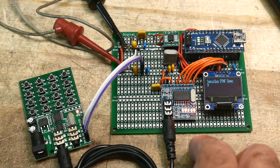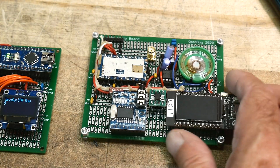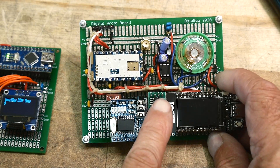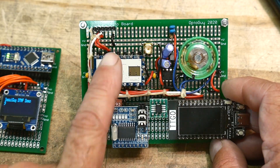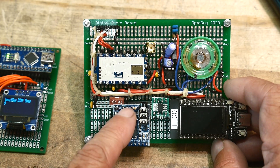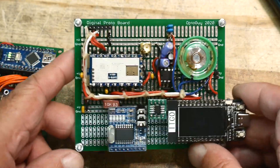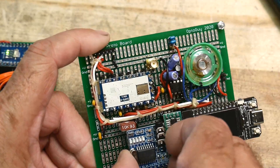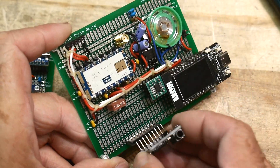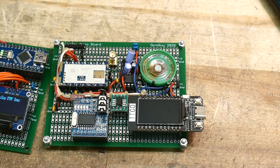My next step is going to involve this board — my radio-on-a-chip controlled by a microcontroller. I'm adding an encoder and decoder to this board, so now it will be able to listen over the air for DTMF and transmit DTMF somewhere else. I haven't wired it up yet — I put these on sockets — but that'll be the next adventure into DTMF.